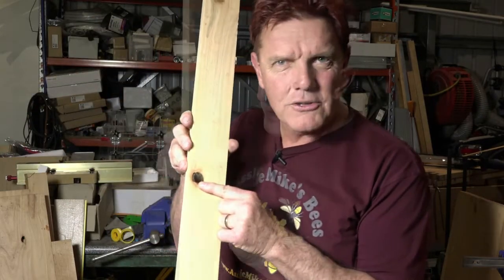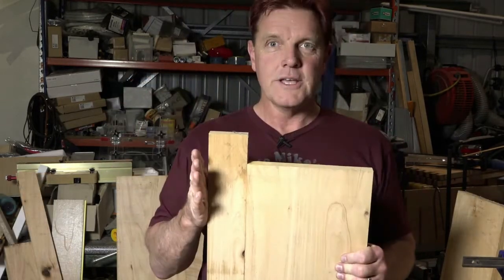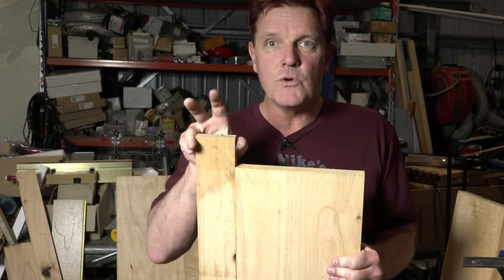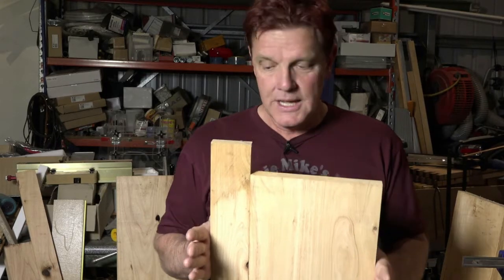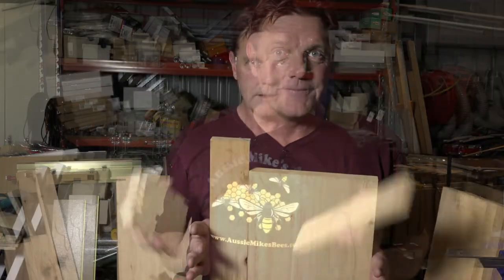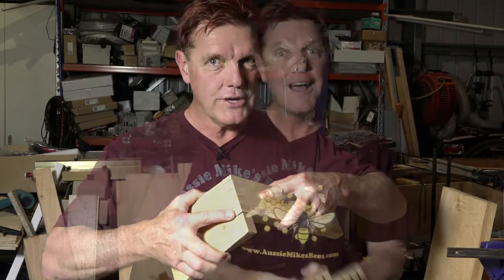There are other deformities to deal with too, such as knot holes. I've got some knots to deal with, and I'll use epoxy, because knots that go clean through can be a problem. The next step is to rip the pieces of wood on the table saw to the correct width, and where I need to add 2 pieces together to come wider than the available wood, I edge glue and clamp those and leave it overnight until it's set. We'll be joining pieces of wood. In this case, I'm using finger joints. Very solid, very strong joint. Let's get going.